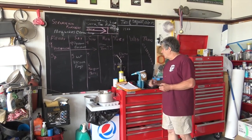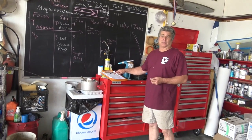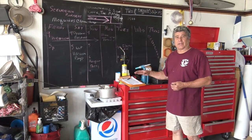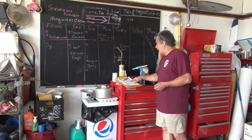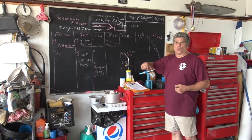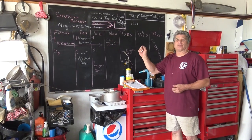So we got our initial calculation. The first run was the IPS, the inches per second acceleration, of 0.33 at 122 degrees. That's telling us that 122 degrees is the heavy spot in the rotation. So we're going to add 180 degrees to that, which is 302. In the ring gear, there are 12 holes drilled every 30 degrees around the ring gear. 302 is very close to 300.